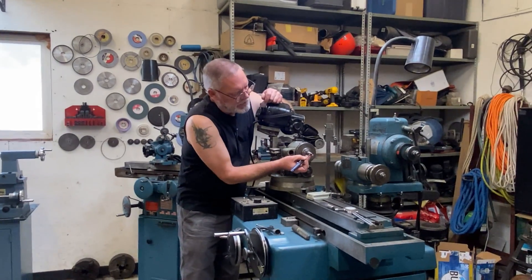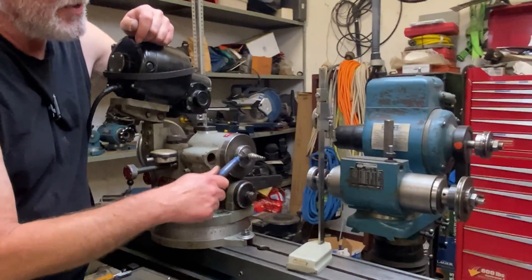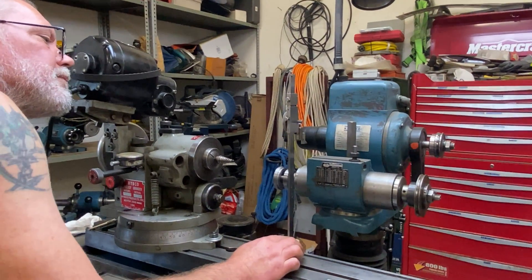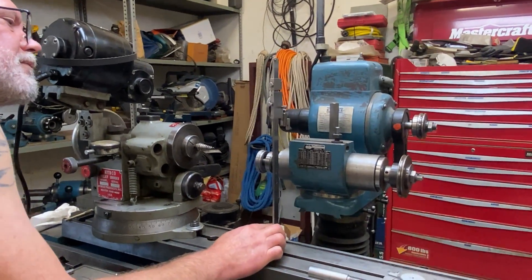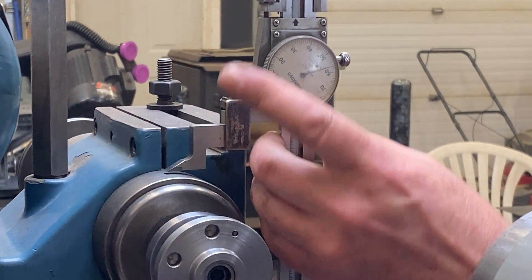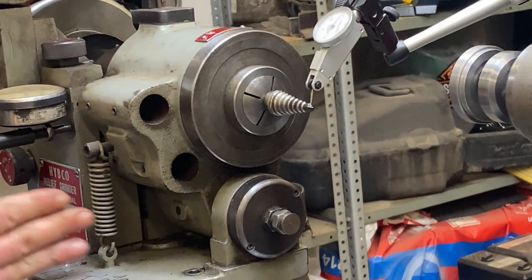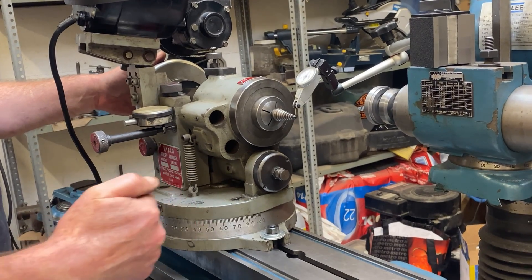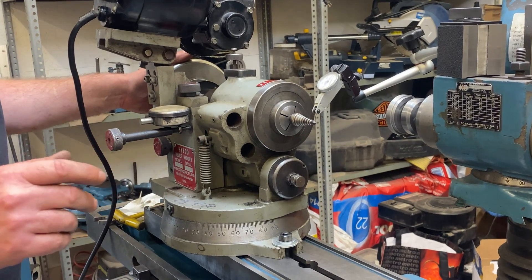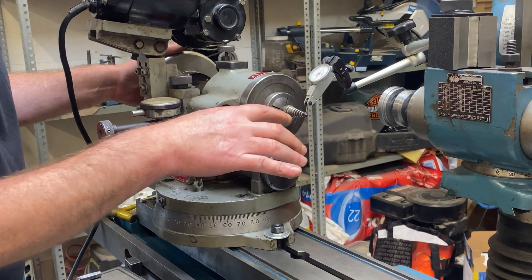Because we're dealing with angles here, I am going to be very careful to get my spindle to the exact same center height as the spindle of the workhead. I have my axial travel locked out, so right now it's only traveling radially. I'm going to match the throw of my fixture to the relief that's currently on the tool.